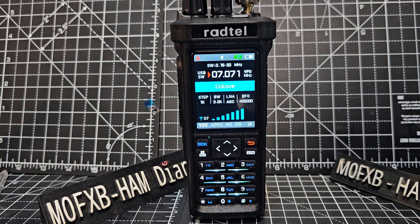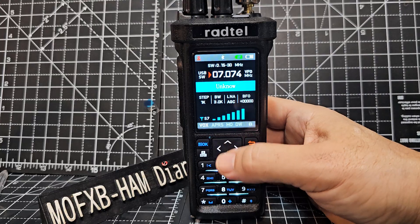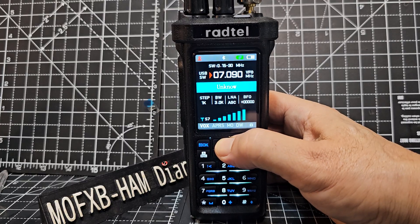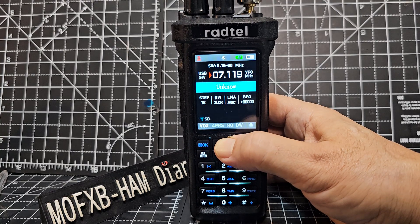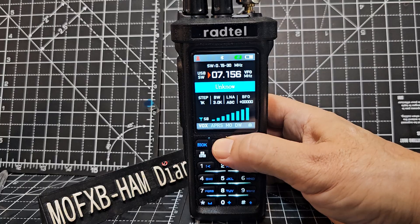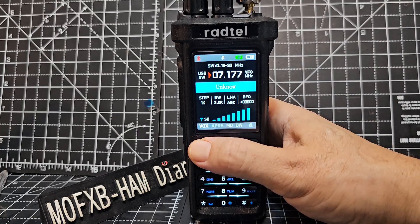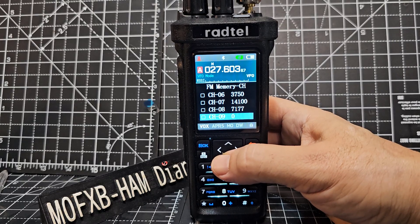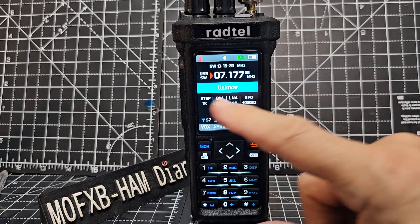It's a fantastic radio for VHF, UHF, airband. It hasn't really moved though — so I'm not really sure the scan's any good, but there it is: FT8. You get any app to decode that and it will. In your area you'll find the frequencies that are busy on HF tend to be the same ones most days. You can just go menu, memory channel, and when you find a frequency that's busy quite often, just save it.